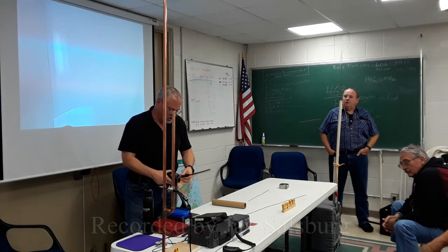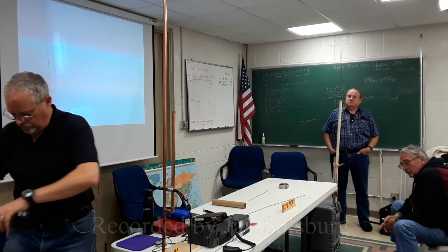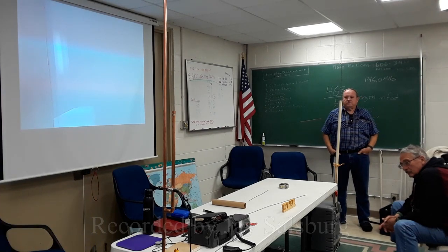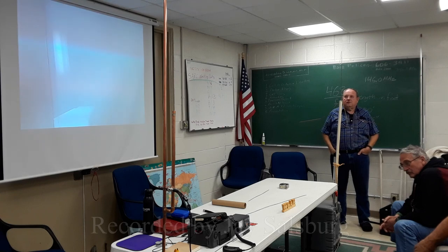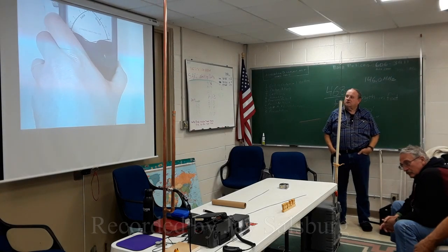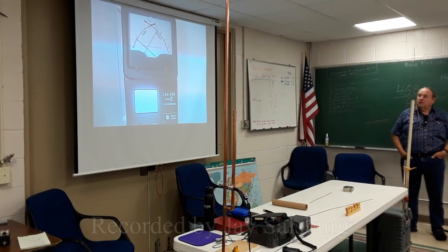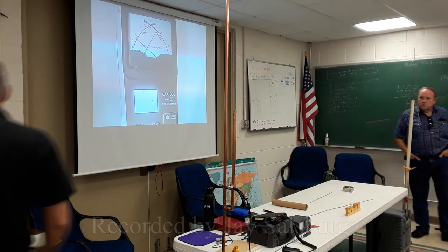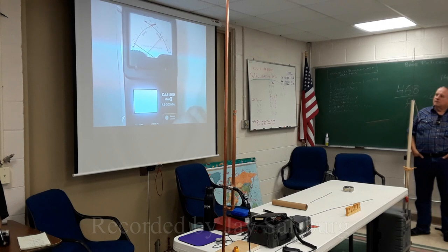So how do you tune a J-pole? Move the connections up and down. What are we doing? Because the pole is already resonant. Remember I showed you that dipole at the beginning? It was resonant, but our impedance was way out of whack. Okay, so let's turn this back on. Let's see where our center frequency is. Oh, wow.